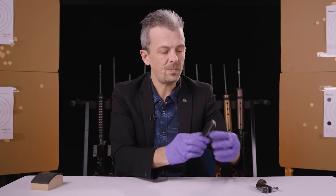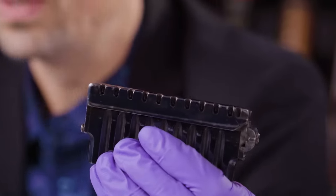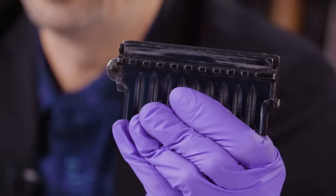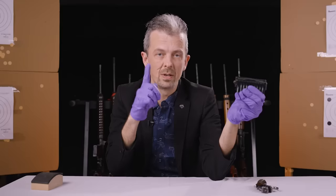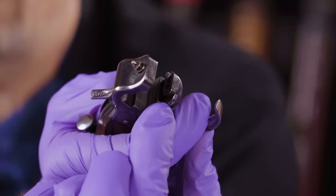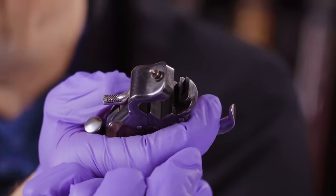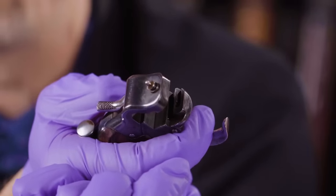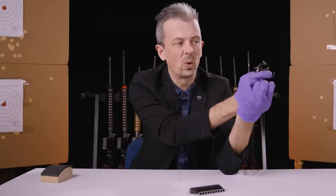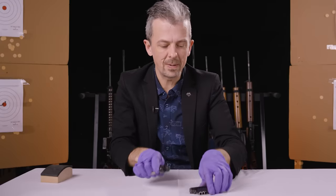A latch is required for loading, because this is - as I mentioned - pinfire, and has a series of pin holes in the top of the barrel cluster. These are your ratchet lugs, analogous to the cuts on the back of a revolver cylinder that are pushed up by the pawl or hand of a revolver. This works the same way. Behind the track that the barrel locks into is another track for that row of lugs to slide in, and that little pawl acts sideways - not vertically like a revolver - dragging the whole barrel unit one step to the left each time you pull the trigger.